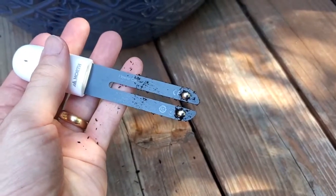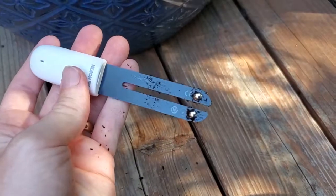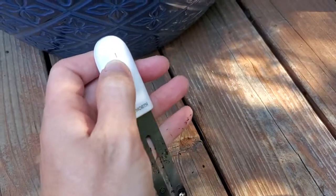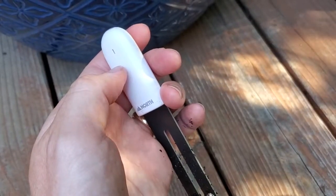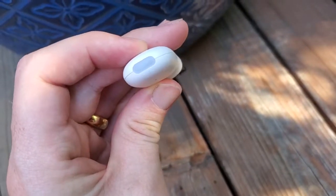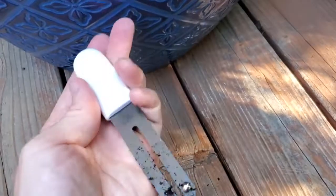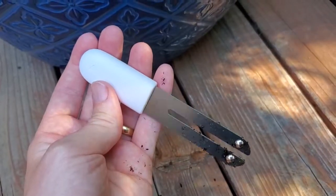I'm assuming it's using those metal contacts to monitor the conduction of the soil, which probably tells it the water level and possibly the fertility level. At the top of the sensor there's a little hole — I'm assuming there's a thermistor, a little resistance-based temperature sensor inside, letting air flow into the inner chamber to monitor temperature. It's also got a clear window on the top covered with clear plastic, so I'm assuming there's some kind of light sensor — maybe just a simple photo resistor — to get the light level. And there's presumably a low-power Bluetooth chip in there to facilitate the connection to the app.